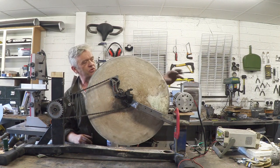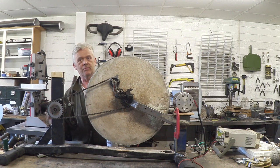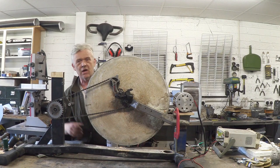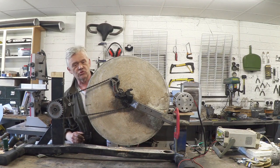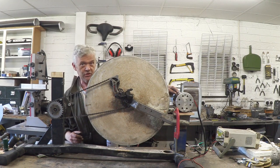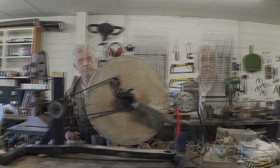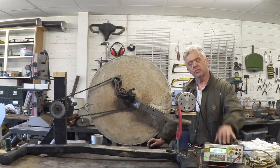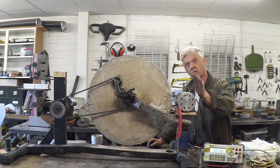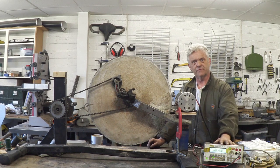Because it can continue to turn it continues to drive the motor. So in essence this is what a KERS system is — it's what's in your regenerative braking, it's what all those KERS bicycles are about. It's just a flywheel linked to a chain, and the other side of the flywheel linked to some kind of output. We've got it on our little motor-stroke-dynamo so that we can actually get some readings out of it. I'm reading a DC output because this is a DC motor, so the commutator actually rectifies the output — we don't need a rectification stage and we read a straightforward DC output.